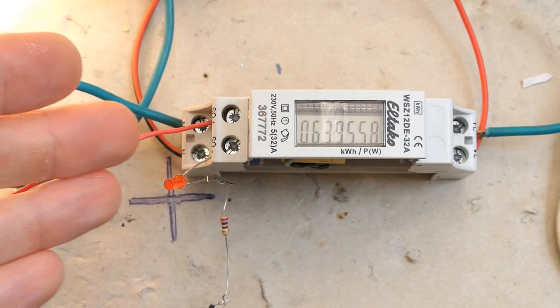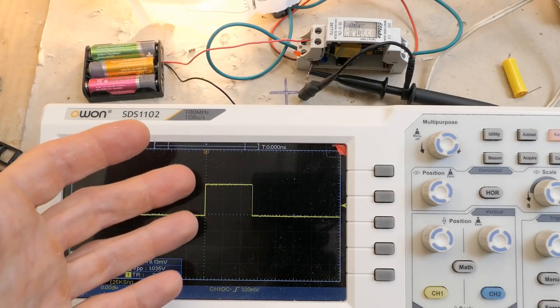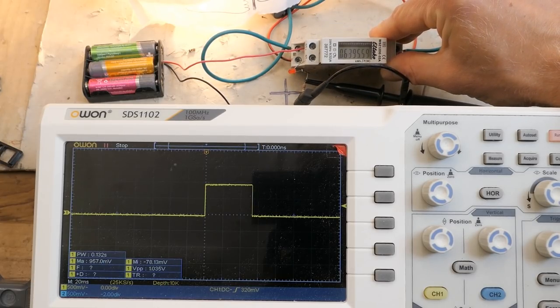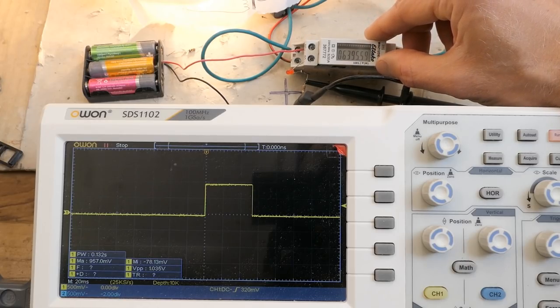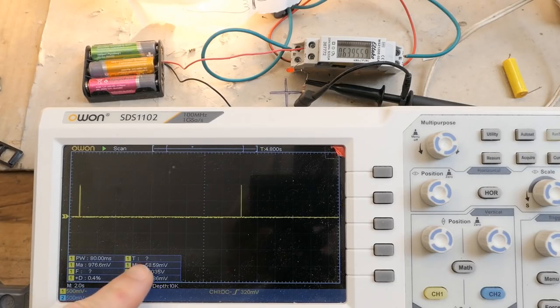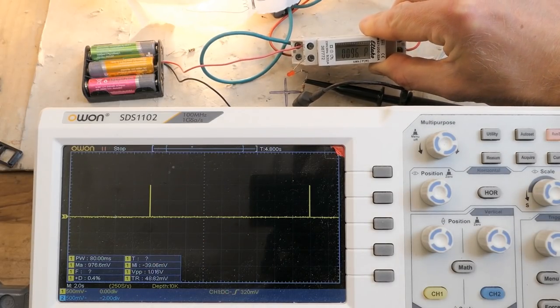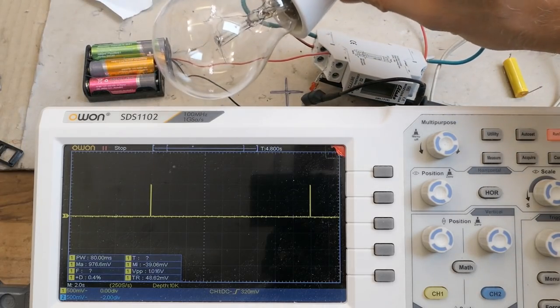Once every so often the LED blinks — it has a series resistor and the battery, and the pulses seem to be a little over 50 milliseconds. Now it reads 93 watts, and the cumulative power consumption advanced — it was something point five eight and now it's something point five nine. The pulse width is 54 milliseconds. The time base is two seconds per division so it's one pulse every 18 seconds, which correlates to the 96 watt draw — roughly 100 watts — and this of course seems right since I'm loading it using a 100 watt lamp.